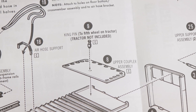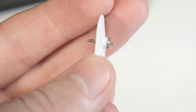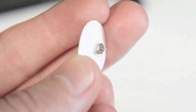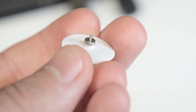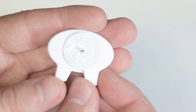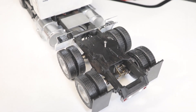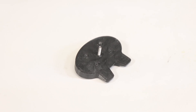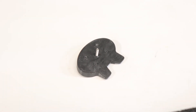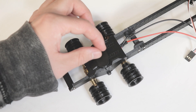Position the kingpin in the same spot where the kingpin included with the plastic model kit would be. You may need to add some washers or space the kingpin down a little so the trailer sits level. Once you figure that out, the magnet clicks right into place and you're good to go. If you don't want to use magnets, there's also this design with a two millimeter opening, allowing you to simply use an M2 fastener and gravity to keep the trailer in place — brutally simple, but it will work for some builders.